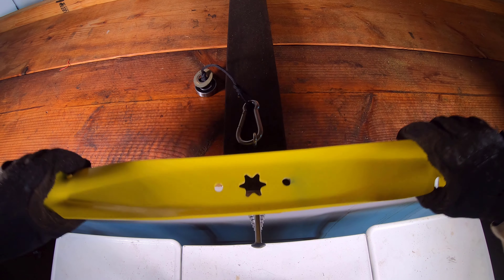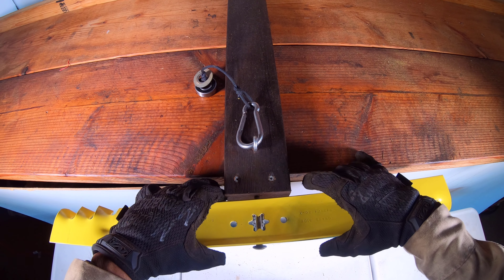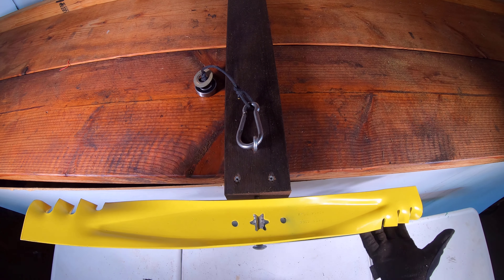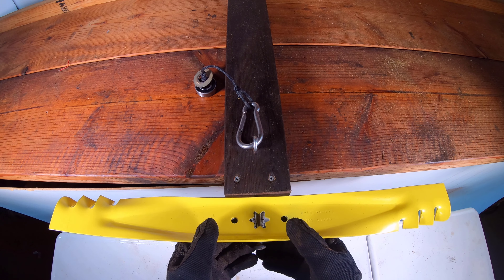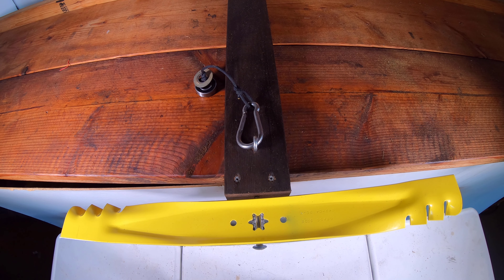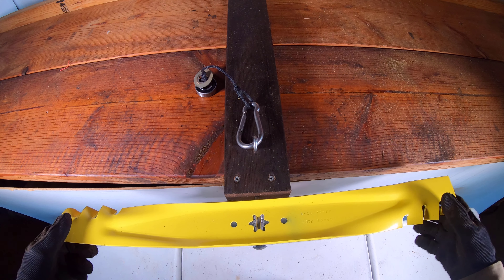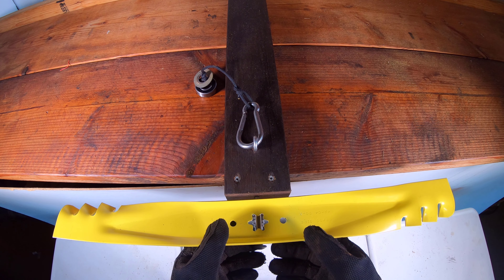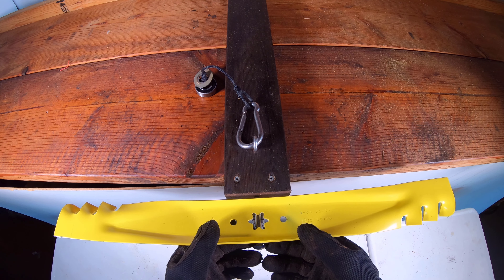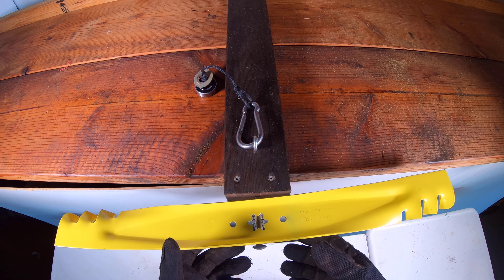An additional way to balance the blade using the carriage bolt would be to place the blade on the top while looking down. If the blade was placed exactly in the middle and it was steady, then it would be balanced. It would likely be that you would try to balance the blade to prevent it from falling. When doing so, you would need to look straight down to see if the blade was balanced exactly in the middle of the edges of the mounting hole. I found this method to be the most compromised without reference marks down the exact center of the blade.